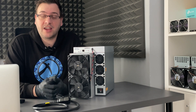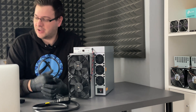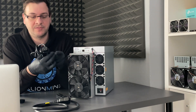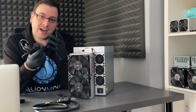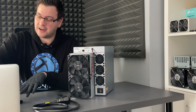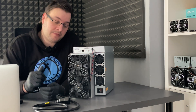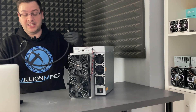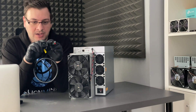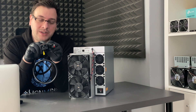IceRiver, on the other hand, on their recent new large and powerful miners, started using C19 cables. These cables are rated for a higher ampere than the C14 cables, so they can take way more wattage. And now a new generation of power cables will rise, because Bitmain just shipped this new Antwire cable. I'll show you to the camera — this is the Antwire cable that will be powering the Antminer S21 machines.